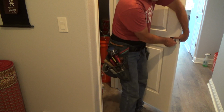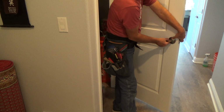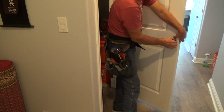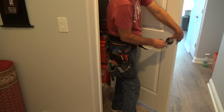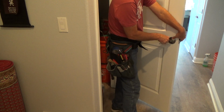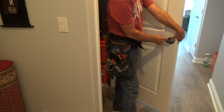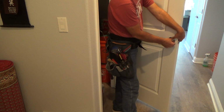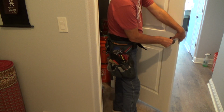I just find the screws, and I like to turn it just by my fingers first. This one's a little bit trickier, but that way I know I'm not stripping, or I'm not on the edge to where if you try to tighten that up, some people are like, yeah, it's kind of going hard, but it's going, but you might be cross-threading it. And I'll just get the drill and screw it in there. And you think you're going to go and go and go, and pretty soon you get the screw almost 3/4 or 7/8 of the way in there, and it won't go any further. And maybe you break it off, or you bend it, or you strip the head off, all because it's cross-threaded. If you can't tighten up a screw with just your fingers to begin with, then kind of pull it back out and work at it again.